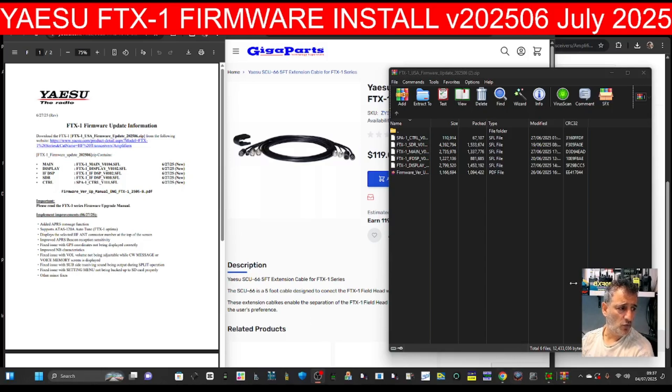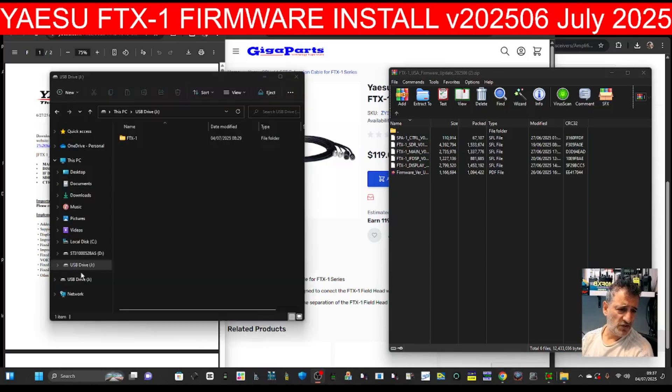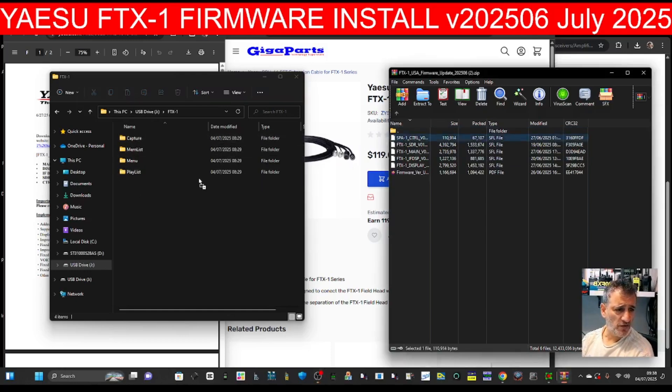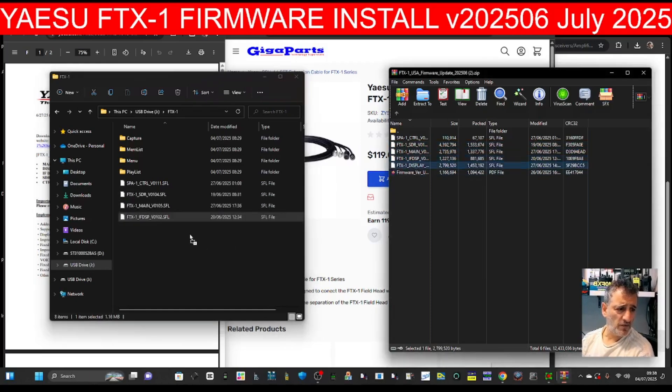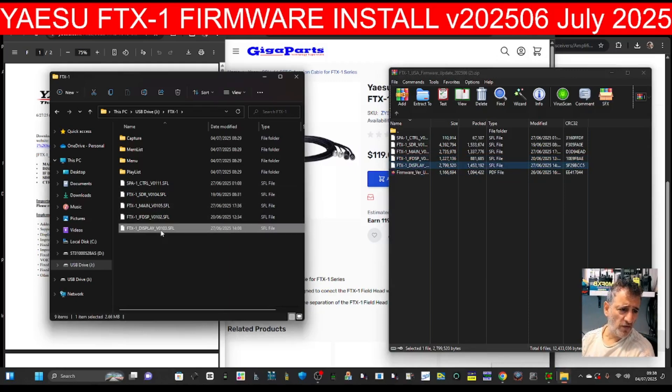On the right here we've got the files we need. Go back to File Explorer and hit the USB drive that's plugged in — you'll see it says FTX1. Double-click, and underneath here is where we're going to place all our firmware files. This is a formatted card, so we drag them one at a time: one, two, three, four — and we do have to do the bootloader first. Five files total.